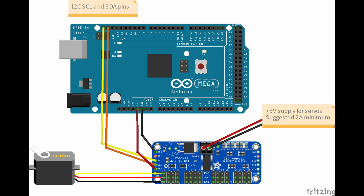The image shows you how to best wire the Arduino and the servo driver. It also shows you where to connect servos. In my case, I will be using the MG996R servos, again because I just had some laying around from previous projects. It's also very important to note that you do have to feed in additional five volts via an external power supply, because the servos' power will not be fed through the Arduino and its power source, but through an independent external power supply.